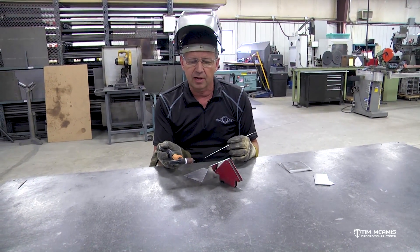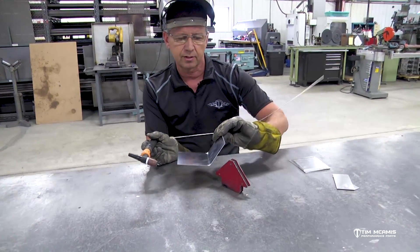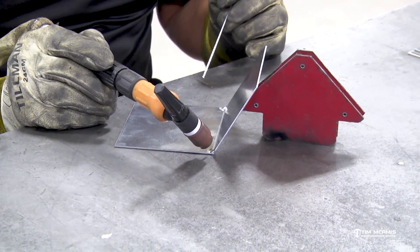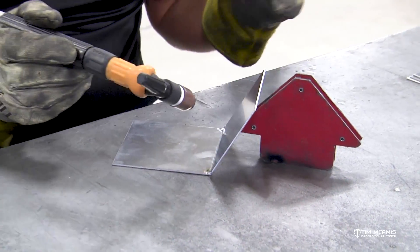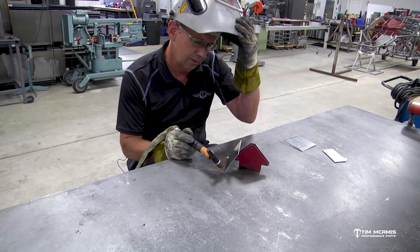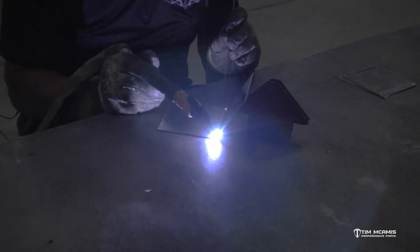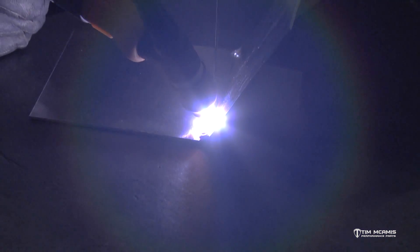You can hear that sounds totally different than what we were doing on the other videos because we've got such a high frequency running through here and we're digging into this aluminum. I just put a couple little corner tacks on here and I'll run a few little sharp beads to give you an idea of what this looks like. I want to get in a position where I can go for a little bit without repositioning. I'm going to get my puddle started and then back off on the heat as I run down, just by watching how big the puddle gets.